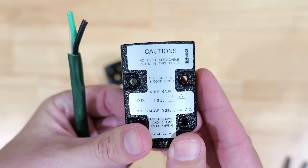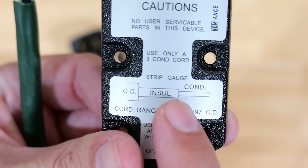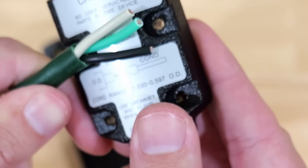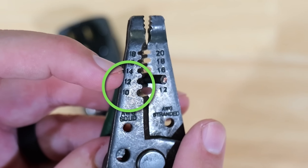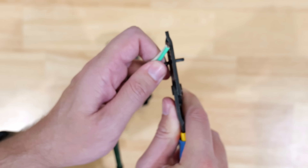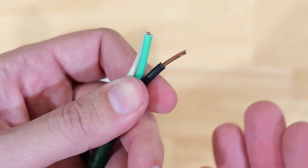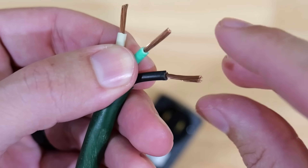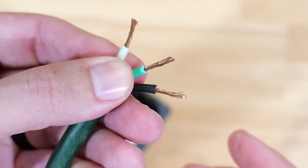The way we can tell how much insulation needs to be removed from each individual wire is by looking at the cover's strip gauge. You'll see where it says 'insulated' — keep that part insulated — and then the other section shows exactly how much copper should be exposed. Mark on the wire how much to remove, then with wire strippers in the correct jaw for stranded wire, clamp down and remove the insulation. This is stranded wire, so be careful — each strand can be fragile and fairly easy to break. Once all wires are stripped, twist the strands together to avoid any stray strands that could break.